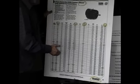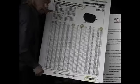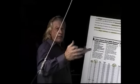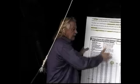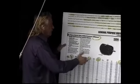And the heat loss on the motor is the current squared times the resistance. This motor weighs 2,200 pounds. It claims to be 96% efficient. The heat loss in the motor is the current squared. You square 225 times the resistance in a motor, and it tells you the heat loss in the motor, which is phenomenal. They're not highly efficient. We're going to show if this motor is efficient, because this motor weighs 7,500 pounds.